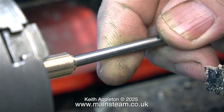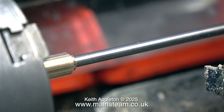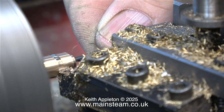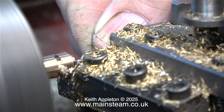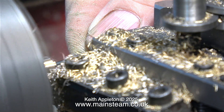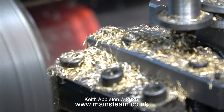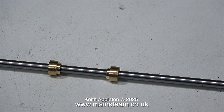I'm going to try the shaft in place — this is a 3/16ths of an inch diameter stainless steel shaft. It's just the fit I need; it needs to be a nice bearing fit. Now it's time to part off the first of the bearings — notice that I use a drill shank in the end of it so that it doesn't drop into the chip tray. In exactly the same way I'm producing the second bearing, and once again I'm using a small drill shank in the end of the bearing to catch it as it separates from the phosphor bronze bar.